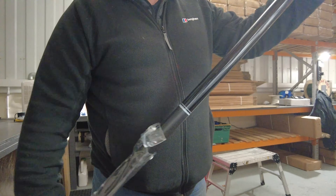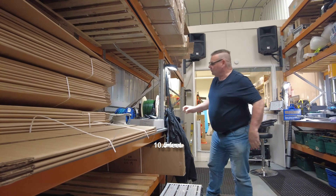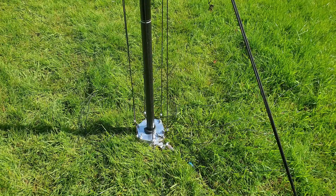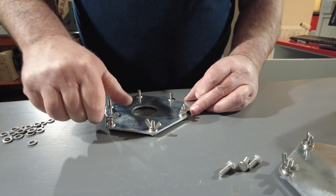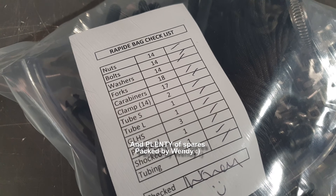In the kit we've got a seven meter pole, some DX10 100-meter reel (330 feet), which we use for both the elements and some small radials — only 3.2 meters — and I've built 24 of those. You can get a kit with all the plates: ground plate, driven plate, guy plate, a mid spreader, and an upper spreader. The kit also comes with an SO-239 assembly which you fit onto the plate. Screw all the stainless bolts into the plates — you'll always get one extra bolt, and if you don't it means you've still got enough.